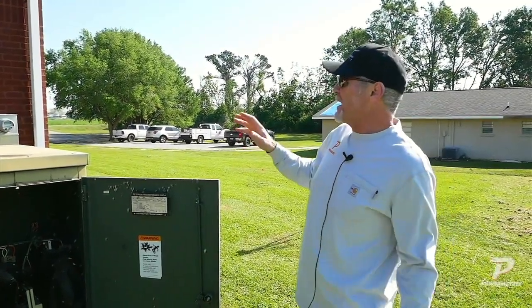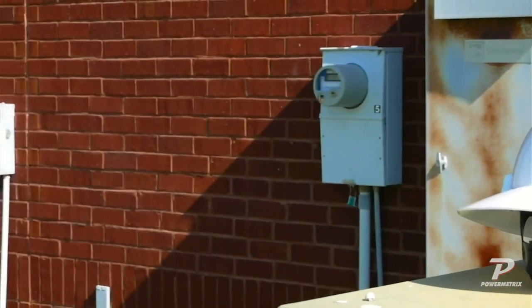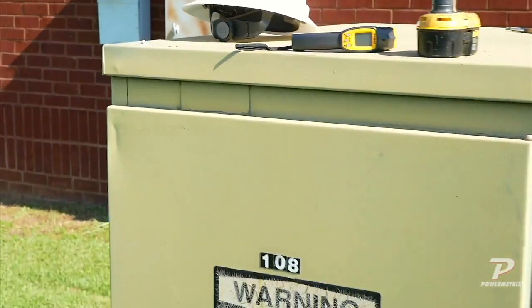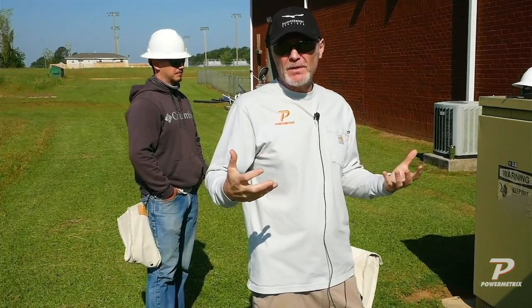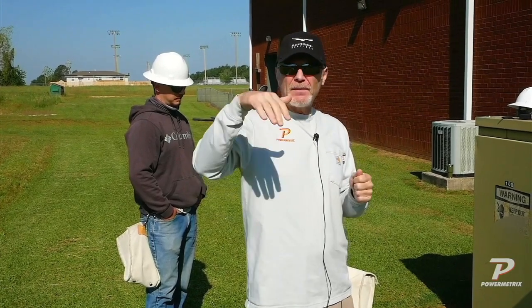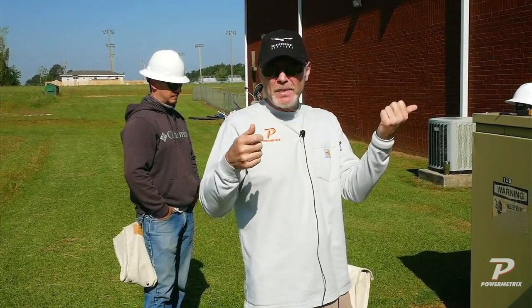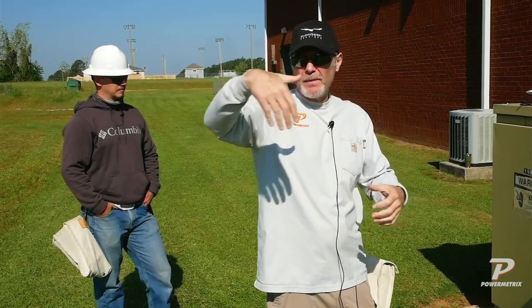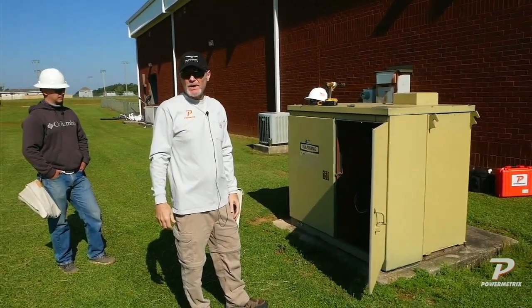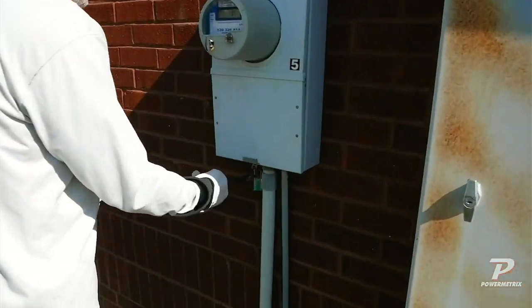In the background, we've actually got two services on the back — one meter here and one meter over here. We're going to inspect both of them. They've got two-piece covers on them. As we mention every time, with two-piece covers we recommend taking the top off as part of standard procedure — it only takes a few more minutes and you might find something up in the top. Go ahead and take the second piece off to make sure you don't have anything like mud daubers or other nests built on the backside of that meter.